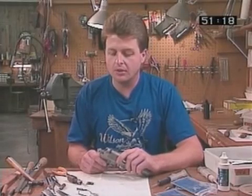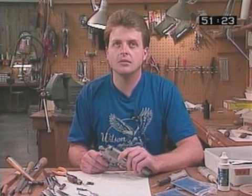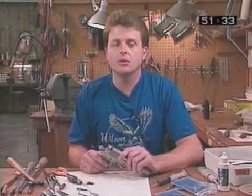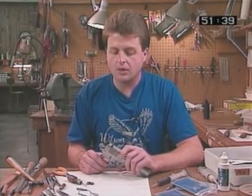It doesn't take very much at all to change what your trigger feels like. Very little effect on the sear nose will go a long way. Sometimes it's maybe something real slight that you might do that'll completely eliminate the creep altogether. Another thing that's real important too is that you have good contact between your sear and your hammer hooks. You need to have both hammer hooks contacting the sear the same amount on each side. Yeah. Right. It's got to be the same amount of metal taken off. Right. You've got to have everything perfectly square.